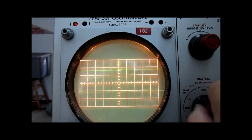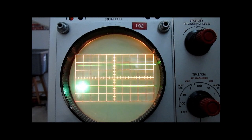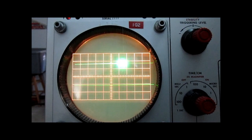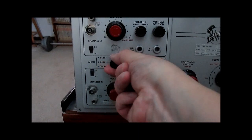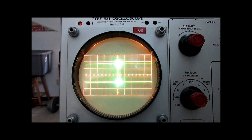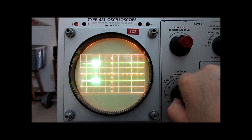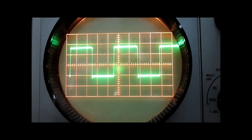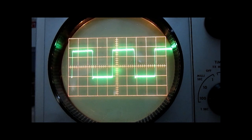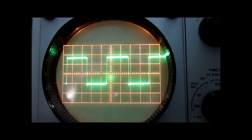There are a number of modes. Alternating shows both traces at once, and they alternate which one is sweeping. You can easily see this if you turn down the sweep rate — you can see the traces being alternated from A to B. So it shows A, then B, then A, then B. Likewise, there's a chopped setting. What that does is it rapidly alternates between A and B. If you turn the sweep rate very high, you'll see what looks like a square wave — a little bit of A, then a little bit of B, back and forth.